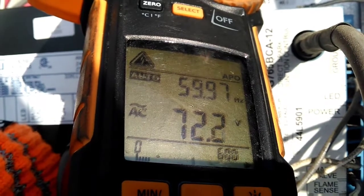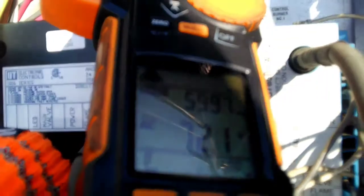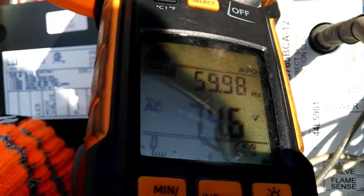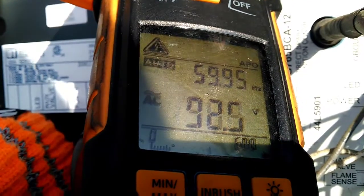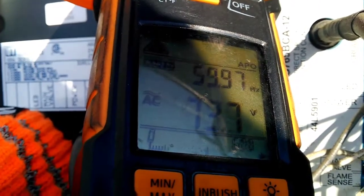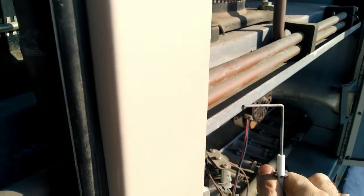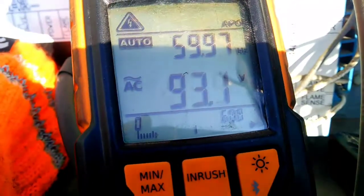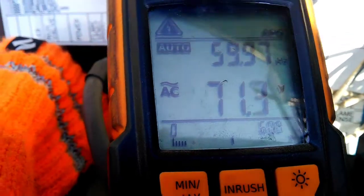The flame just dropped out because we couldn't prove it, and there's not really any drastic change to the voltage — it seems pretty consistent to when the sensor was connected to the burner. One interesting thing I want to show you: when I take the flame sensor and touch it to ground, look what happens to the voltage — an instant spike. That's what I'm doing here, touching the flame sensor to ground, and we get an instant spike.